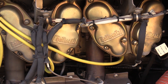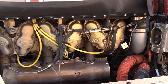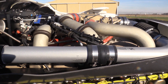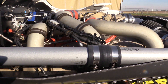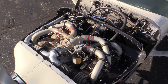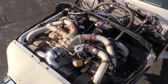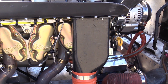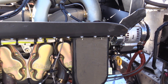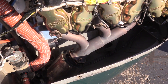The main difference is the cylinders themselves and the induction system. With the cross-flow cylinders, the induction comes in at the top and the exhaust goes out the bottom. The tuned induction system sits on top of the engine, so the cooling air that comes in through the nose bowls cools the induction system, then cools the cylinder, then goes out through the cowls. This allows us to isolate the induction system and keep it cool.